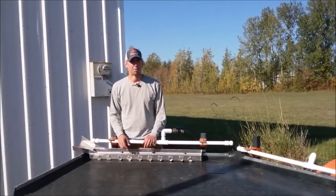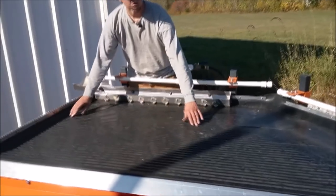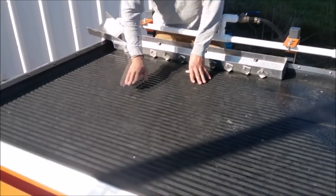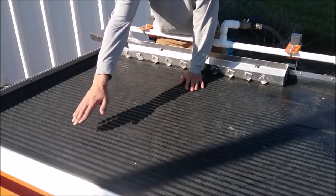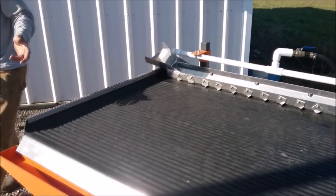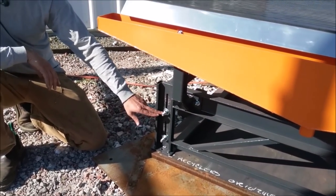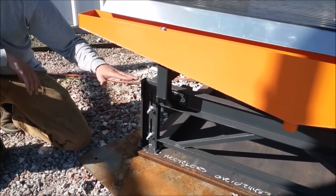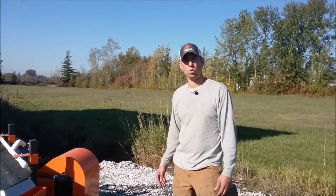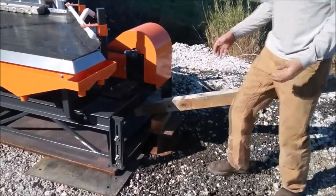On the initial setup of the shaker table, you're going to need to level the table. In line with the grooves needs to be level across, and the slope towards the tailings trough should be a quarter inch per foot, sloping down towards the tailings trough so the material can flow with the water. The adjustment for that is on the shaker table legs — the legs are each slotted and there are two bolts that you loosen to adjust the position of the leg, and in doing so you can adjust the level of the shaker table.